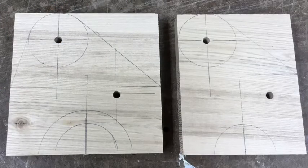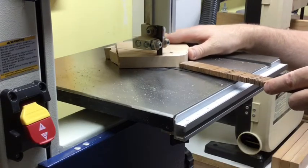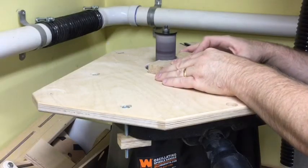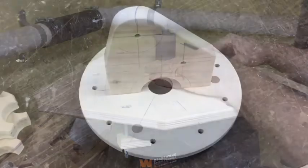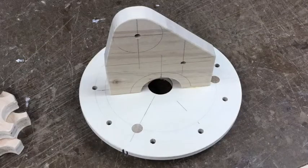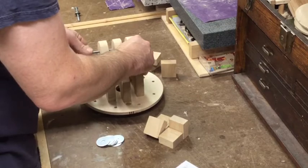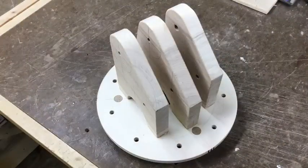There are three parts to the mounting bracket that hold the boom in place. There's one larger central piece and two smaller ones on the side. All three get shaped, and there's a semi-circle cut out of the bottom so I can get a wrench in and adjust the lock nut that tightens on the rotation plate if needed. The central part is glued on first, then I use a couple of sections of threaded rod to align the side pieces and glue those into place. I also use pins up through the bottom.